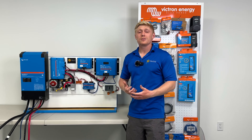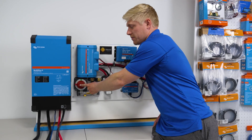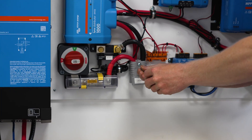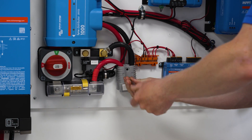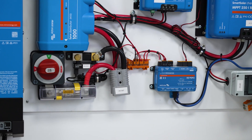Now let's get into how to install it. First, make sure the battery disconnect is off, and then unscrew the two Anderson connectors that come screwed to the board to secure them during transit. That'll give them a little more wiggle room and let you actually plug things in.